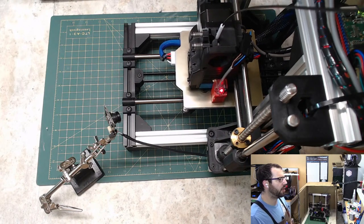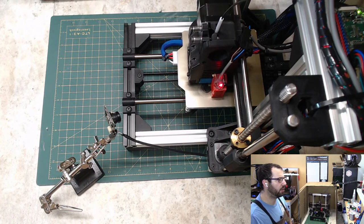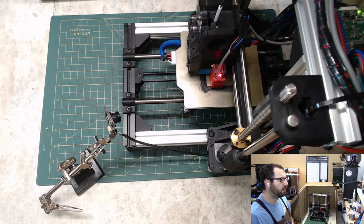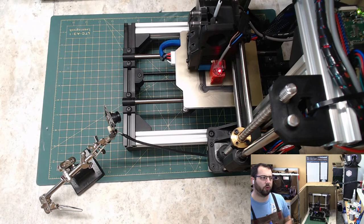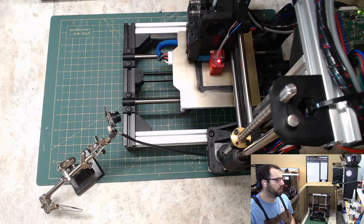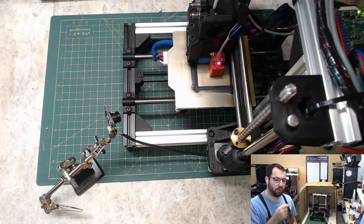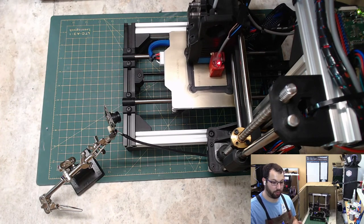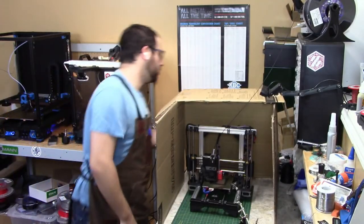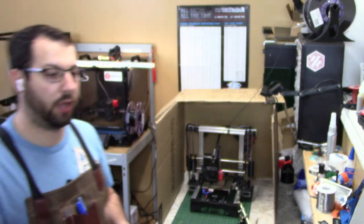I have an Orbiter extruder that I want to adapt to my Prusa or to my Kossel Linear Plus. Other than the mount, which I can create in Fusion, would the VREF from the... okay? So yes, your voltage depends on the stepper motor. If you're swapping out the motor, or a motor you're currently using were to be put in another extruder body, say I have a crappy Creality Ender 3 extruder, right? The extruders that come on Creality printers are garbo.